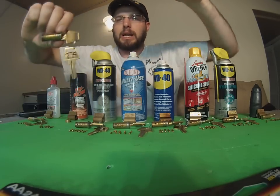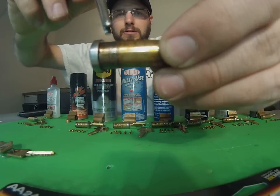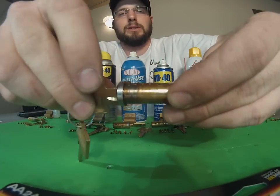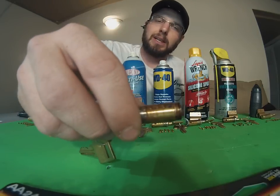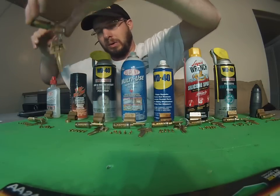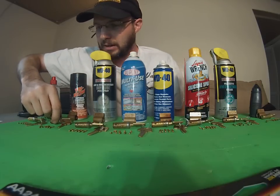You're just never going to know until we put it to the test. When we pull this out and see how the pins stick — they should not do that, they should all fall right back down into place. This is why we don't put oil-based lubricants into a lock. All that stuff builds up and they don't fall back down. If you ever had a spring collapse or get over-crushed, this is going to be the result — a lock that fails. Tri-flow is not one of my better suggestions for locks.